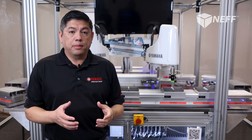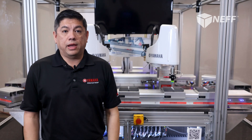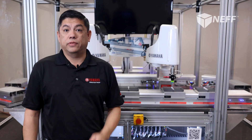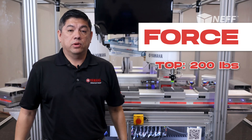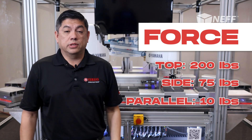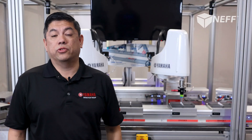There is no need to capture the pallet, pin it, or lift and locate it to present the workpiece to the robot. When the pallet arrives, a precision industrial robot can interact with the pallet immediately. Because of the dual THK rails and the solid aluminum extrusion design, you can exert up to 200 pounds of assembly force from the top direction directly on the pallet while the servo is on in station, or up to 75 pounds of assembly force perpendicular to the rail. Parallel force is limited to 10 pounds due to magnetic coupling power. Knowing where every single pallet is on the system — with absolute positioning fed back to individual PLC registers — is a controls engineer's dream.